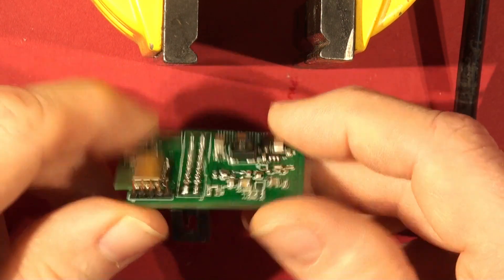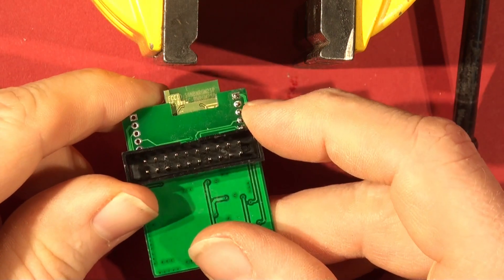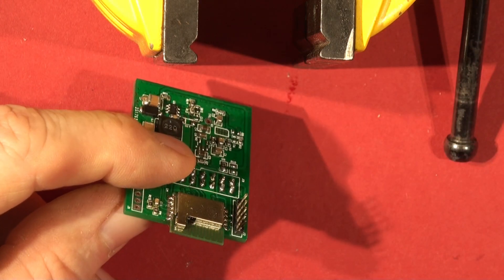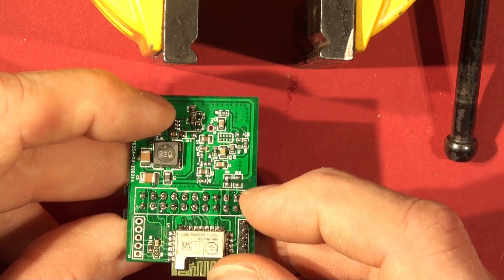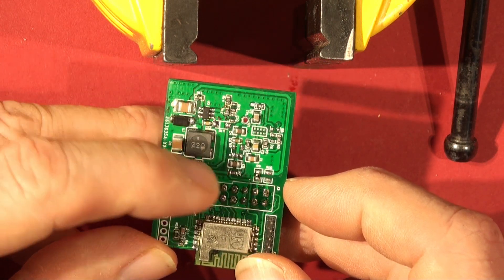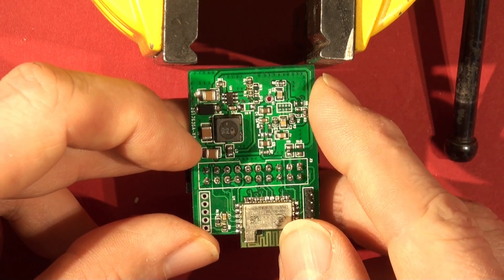I designed this mesh board and put the connector on the wrong side. It's a 20-way 0.1 inch pitch IDC connector, and I'm going to replace it with an ordinary dual-row pin header. At the moment, with them on the wrong side, pin 1 and 2 are swapped, so the odds become the evens and the evens become the odds. In this instance we were lucky — no magic smoke was released — but it could have been nasty.